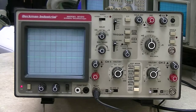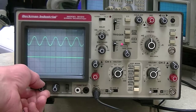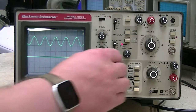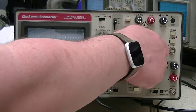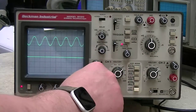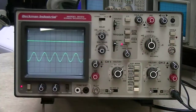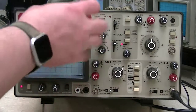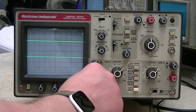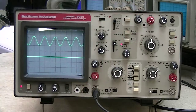The oscilloscope is all back together — let's try it out. I've got it hooked up to my Heathkit audio generator at about one kilohertz and 300 millivolts RMS. I flip it on and it works, which is great. What's really nice is the controls are really quiet now — no jumping around at all. Channel two is the same way, nice and quiet. Before I cleaned these controls, every time I turned a knob everything would go nuts until I spun it around three or four times.